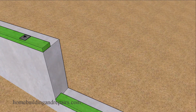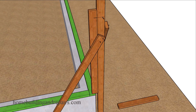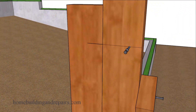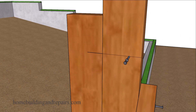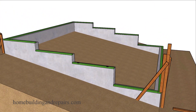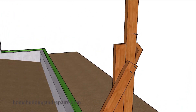In order to calculate the height of the framing studs, you can simply cut a board like we have here, or measure from the top of the framing plate to this line and then subtract three inches. You're going to need to subtract the width of the upper framing plates. Remember, this line represents the top of our framing plate — or the top of the wall that the joists are going to sit on — so we subtract the width of our framing plates, which in our case will be three inches.